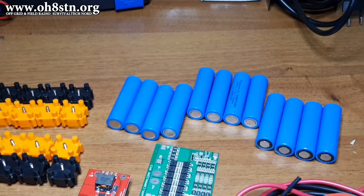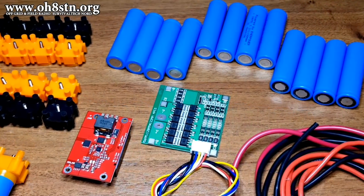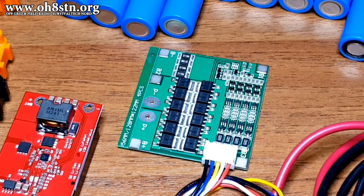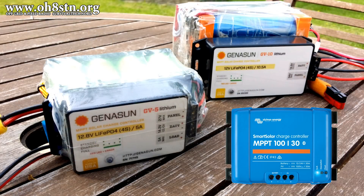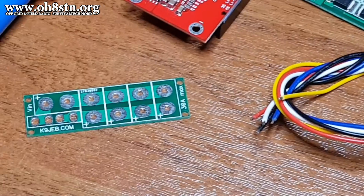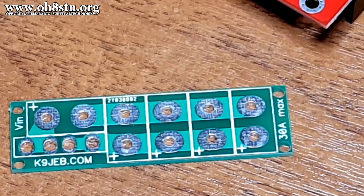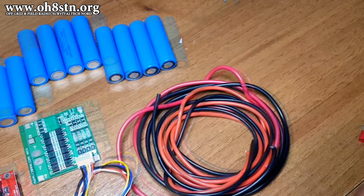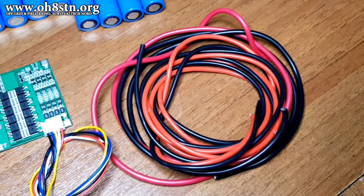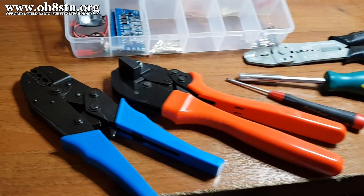Let's look at the rest of the gear we'll need to make this battery kit complete. Since our build is lithium-iron phosphate, we'll need to acquire lithium-iron phosphate 18650 cells. We'll also need a BMS. Since we want to charge off of solar power, we'll need a solar charge controller — we'll leave it up to the builder to decide which one is right for their build. I'll also be using a board from K9JEB.com for DC distribution, called 'Better DC Distribution for Portable Ops' — link in the description. We'll need wire and connectors, so make sure the wire is the proper gauge for the amount of amps you'll pull out of the pack, and make sure you have the right crimping tools for your connectors.